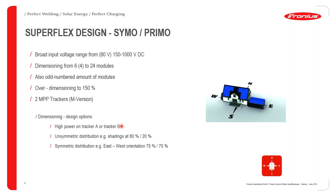So if, for instance, we can talk about MPPT A and MPPT B. And in this case, for a complete installation that is 80 plus 20, meaning that is 100% of your installation, whether oriented east, west, or north, south, our MPPT 1 or A can take up to 80% of the installed capacity of your installation, and MPPT 2 or B can take 20% of that. So this is in a case where your roofing does not allow even numbers of panels to be put on both sides of the orientation. So not many inverters are going to offer you this possibility in the market.